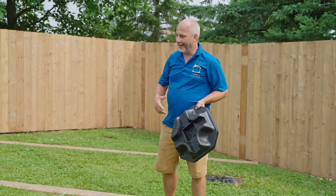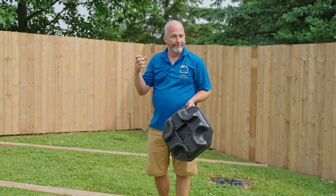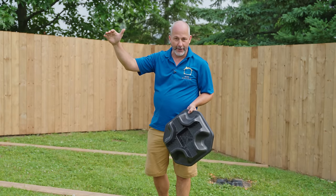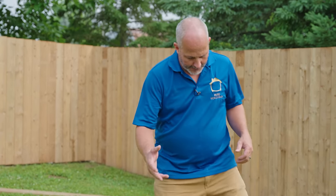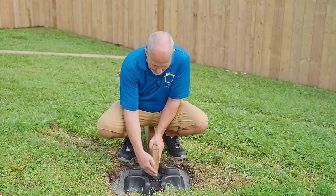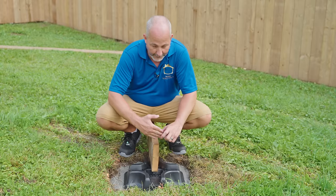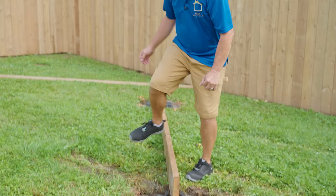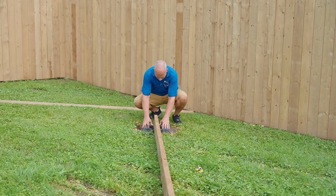I like to overbuild my structure — I love to build with two by eight or two by ten. If I build it like it's going to be a deck on the second floor of a house and up to that code level, then I know my base is going to be secure for at least 50 years. So what we're doing is we're just setting our bases so that I can get a four by four post — visualize this coming out of the ground — and then my rim joist is sitting right on top of that. That's my point load transfer location.